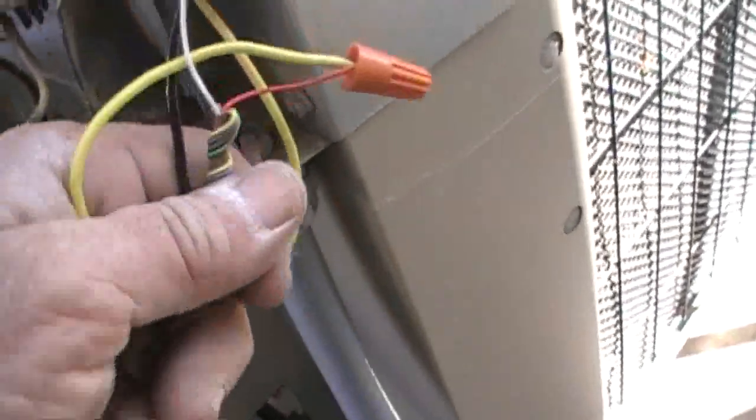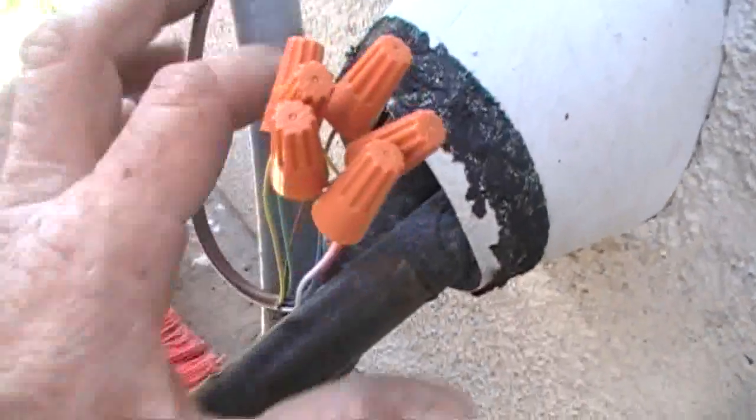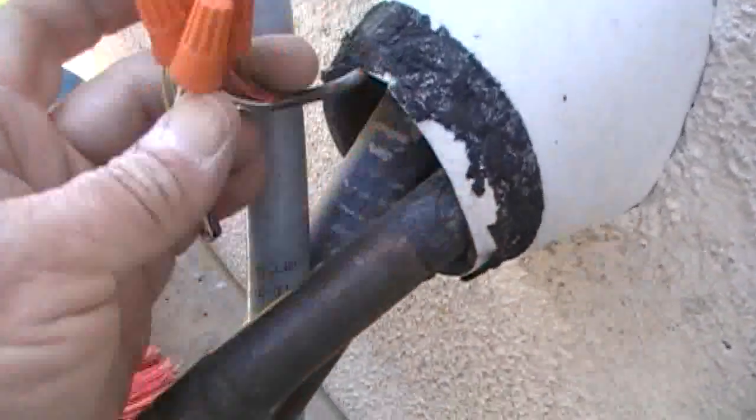Get your damaged wire cut away, put that all together, tie it in there — nice and neat, probably two hands to do it neatly. Splice all your wires here, all six of them at the flashing. That way you can probably secure one piece of conduit right to the other.